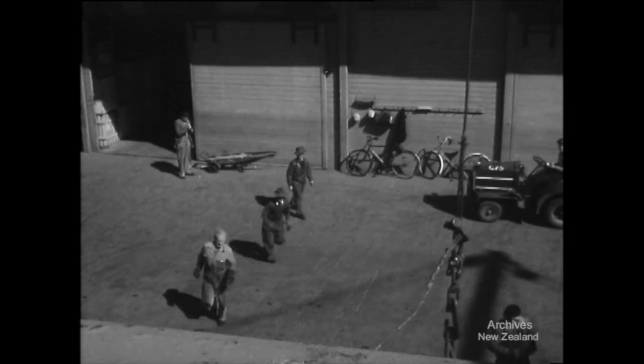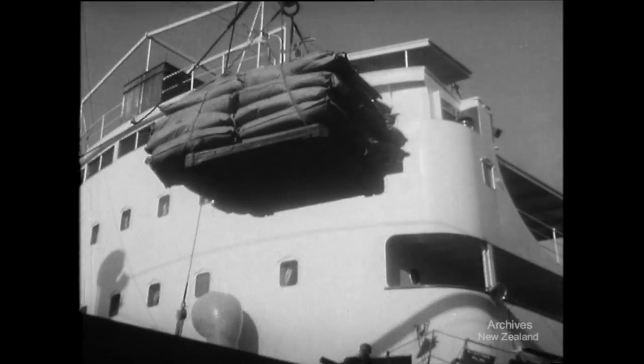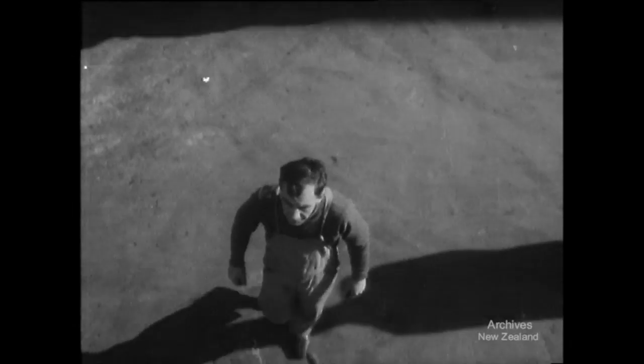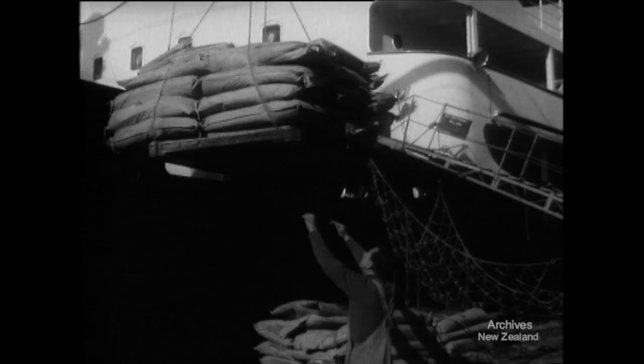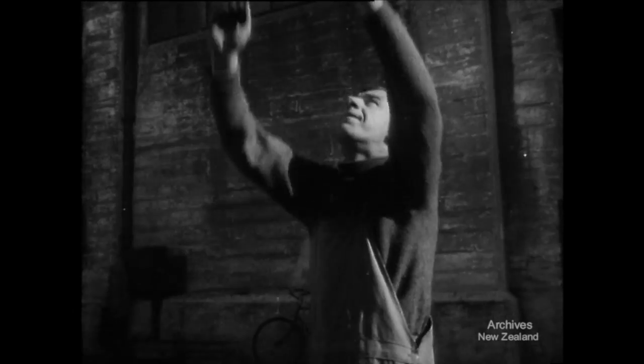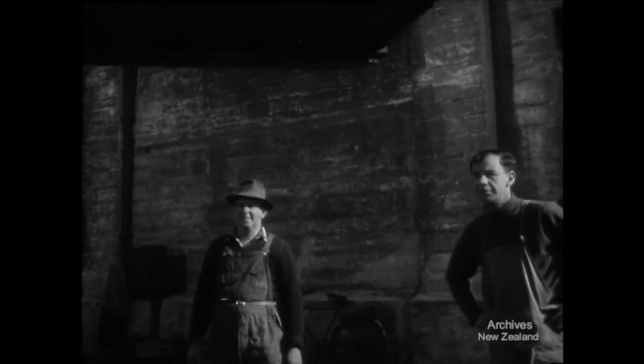You'll live longer if you keep on the right side of the sling. In a case like this, why not wait till your load is low enough to handle? Taking a weight when you're stretched like this can cause strains, hernia, and other injuries. Take it easy — wait till the load is at the right height for you.